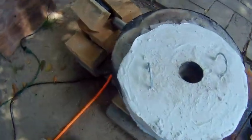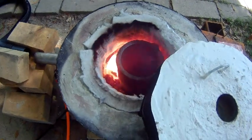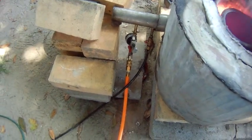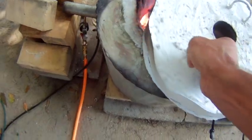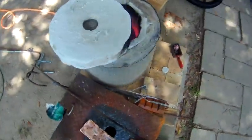But there's no videos out there that show how to cure a crucible. And that's my crucible right here. Got the little setup — the air pressure gauge, oil fired. What we're doing right now, you can see it's getting red hot. We put a little borax in there and we're bringing it up to temperature real slow so we can cure it.